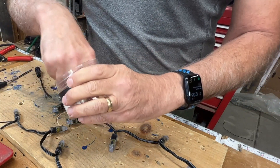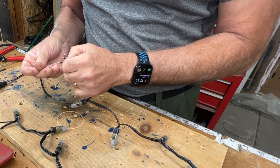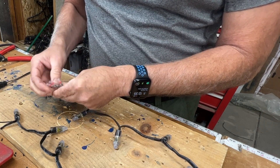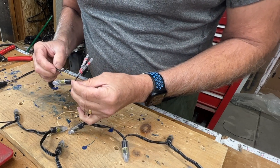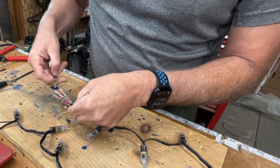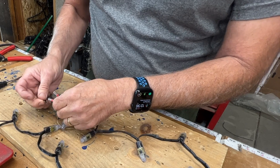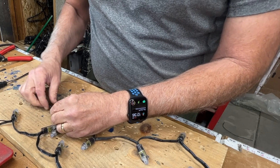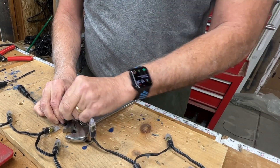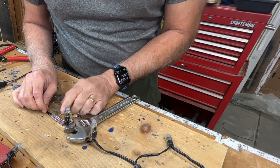I have these solder sleeves — I'm going to take three of them. I have pre-cut the pixels here, then put them on and slide the sleeve over all three wires. Now I'm going to double check where my ground is. There's my ground — it's the one with a white stripe on it. You've got a white stripe on the male connector here. I'm going to slide that in, then do the middle one. The solder already on it actually makes it less likely to fray, so I always like to do that one last. I've got it in position; now I use simple crescent wrenches to hold it in place on my piece of wood and slide the solder portion of the sleeve right over the exposed wires.